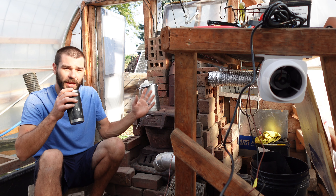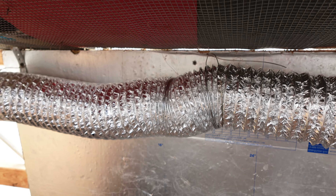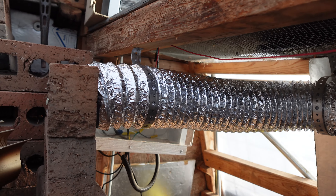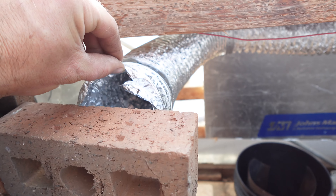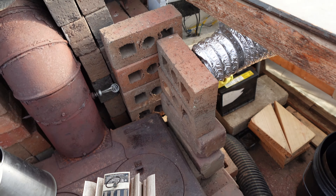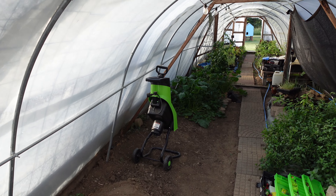I think I've covered everything I wanted to cover. We can check the actual system out now and plug it in and see if it works properly. We've got our fan mounted under the bench. We used some wire to keep this pipe relatively up-kept so I don't have to worry about when I'm stacking wood in here — breaking, bending, or popping this. We've got it routed with basically a 90-degree bend here, some homemade brackets, and you can see we'll be able to pull right through this brick that is getting heated up. This is sitting about a foot or less away from the exhaust pipe, creating a lot of heat, and the brick is still warm. The fire's been out for maybe 15 minutes now — the thermal mass of the brick is going to hold a lot of decent heat to be blown down through the tunnels and beds.